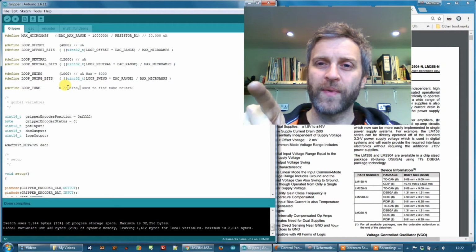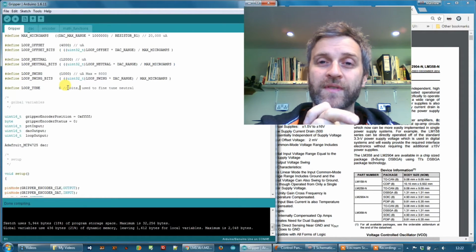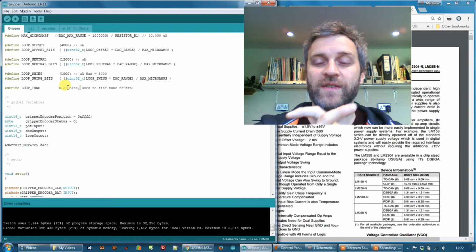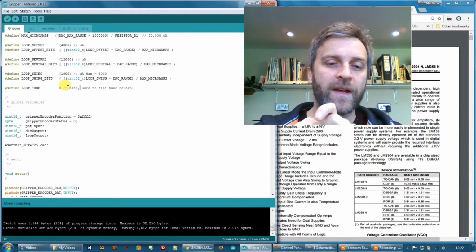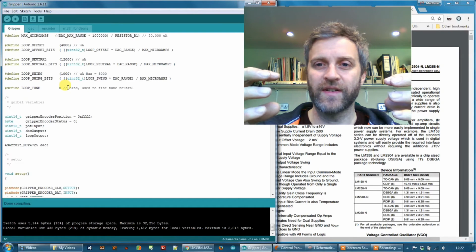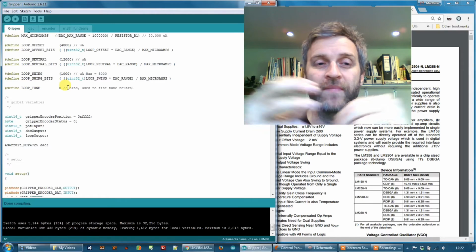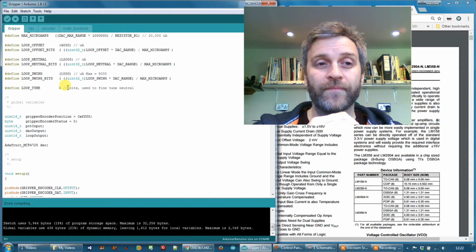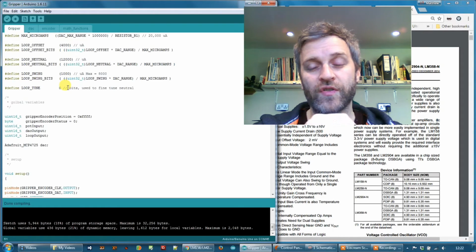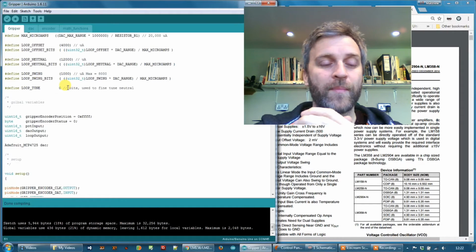and also to add a little bit of offset to the valve, because when these valves are underlapped, and without going into too much explanation of what that is, when you've got a cylinder which has a different bore to the annulus side, there's different surface areas, it will want to drift in one direction. Especially without a closed loop control. So I can also tune the loop slightly so that the center point will stop that drift from happening.